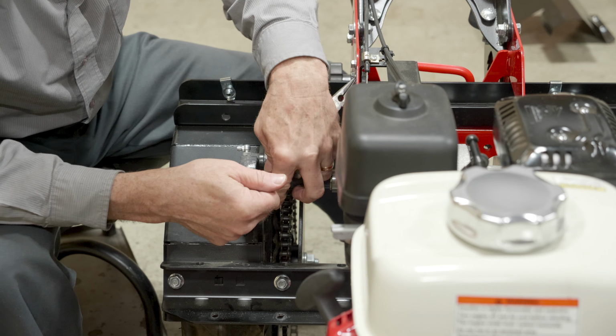Okay. Now that we've removed the chains, we need to loosen the bearing and the sprockets with loosen their set screws. So we're going to grab that 1/8 Allen wrench, and you'll see the set screws on both the bearing and the sprocket here. And there are 2 set screws on each one. So we do that, we turn it a little bit, get both of them. And there, that one you can see rotates.